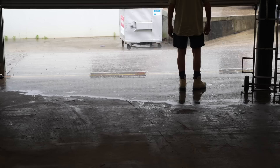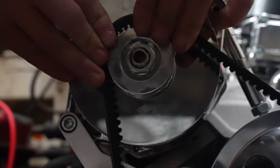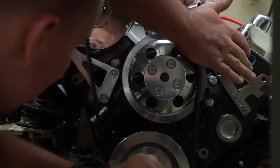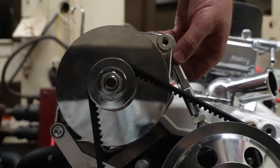After the weekend we got some rain, which was really good for the audio recording. Rob starts by fitting the belts to the alternators. When running, the alternator converts the motor's mechanical energy into electrical energy, keeping the batteries charged up. We'll recheck the tension once we run it because it will probably bed in a little bit.